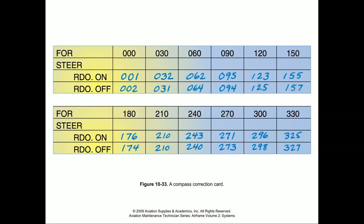That deviation is allowed, but it's limited — we can only have 10 degrees of deviation in any particular direction the aircraft is facing. This is a normal procedure. What typically spawns a reswing is a change in equipment: if we install a new radio or change cockpit equipment that could affect the magnetic compass, we'll reswing with that new equipment to determine the actual deviation. That's different from variation. Variation describes the fact that the magnetic north pole's position relative to true north varies depending on where you are on earth. Deviation is caused by the equipment and installations inside the aircraft.